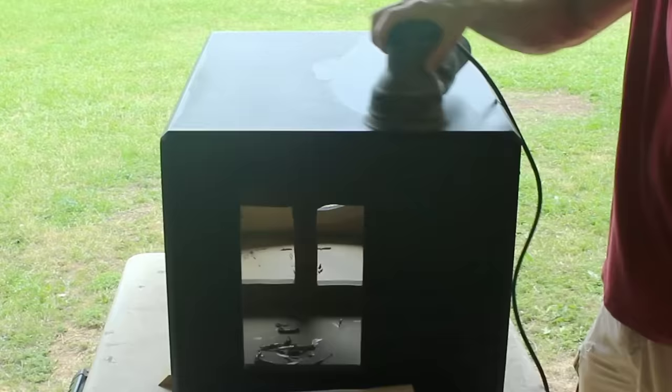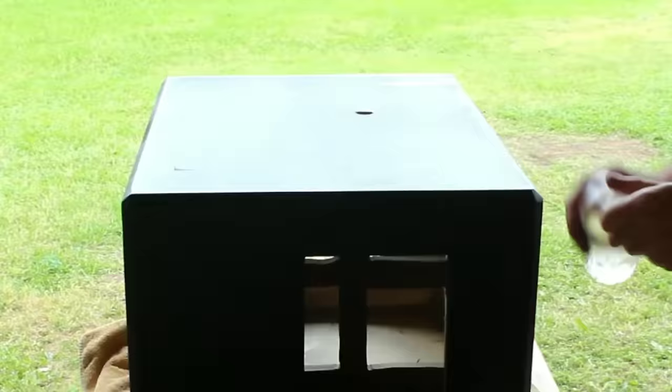And we're going to have to use water. Do not try to do this without water. Normally, what we're using here is a sander made for wood, and the particles of wood would be collected in the little bag. But this has water in it, so it's not even getting sucked into the machine. Everything in there is still dry when I go to dump it out. There's wood in there right now, some MDF dust. It doesn't pull into it because it's weighted down by the water.